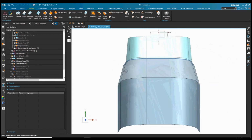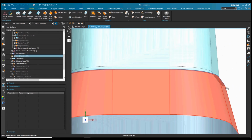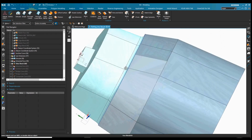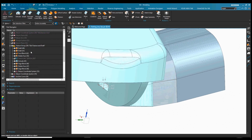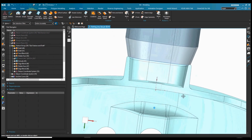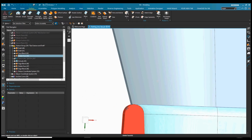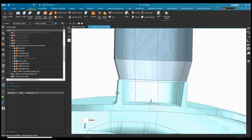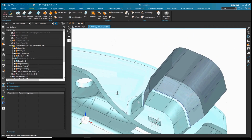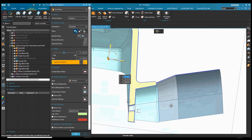And when we look at this area again, this is what we looked at before, undercut on the core, but now that it's on a slide it doesn't matter because that's going to pull out in the direction. So with this full draft, we don't have to worry about an undercut core and changing the parting line like we did before. And you can see that's still a decent 90-degree corner coming off the full ball radius. And we'll have no sharp slide or cavity steel condition in that area. And if we just cut a section to see what the side view would look like there.